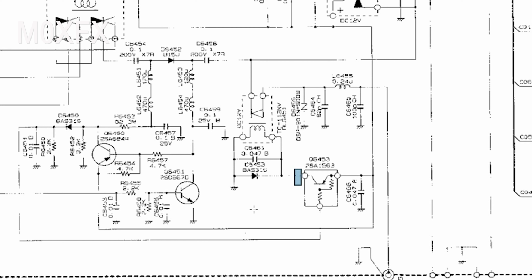They are quite sensitive. So I think that this here has gone faulty, because we did some voltage checks on it. This is a switching transistor, and it's got internal resistors. It's just for internal biasing, so it's the ease of switching, and manufacturers like them because it gives them a lower component count.